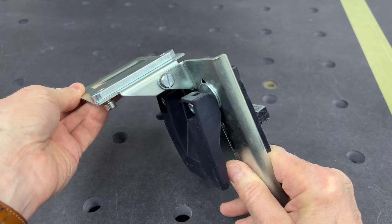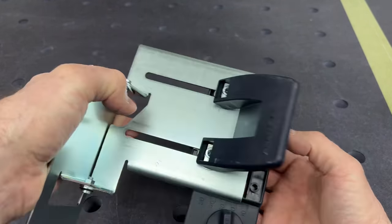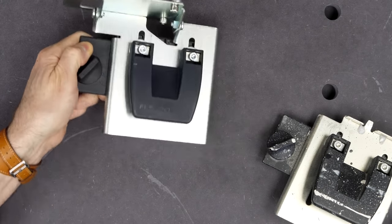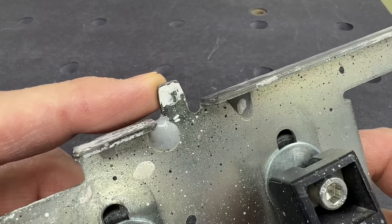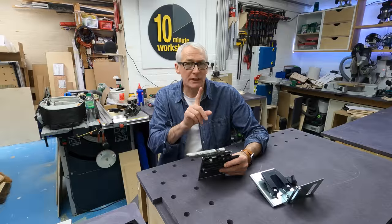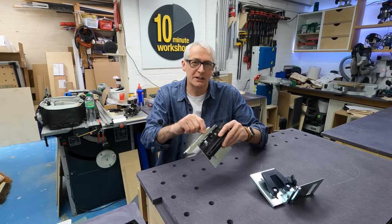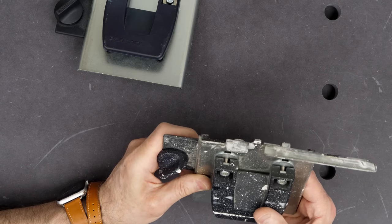But in reality, there are some things about the Festool hinge that really bug me. One is all down to the construction — it really doesn't hold itself very well horizontally. As you change the height of the rail, there's a certain amount of slop in there, which means that this doesn't always stay true. And at the front, on the front rail support, this little pin that locates under the guide rail into the T-slot is steel, and it wears a little groove in the underside T-slot. Eventually, that introduces a certain amount of slop — this basically generated an entire slop-stop industry.